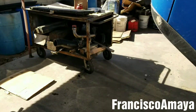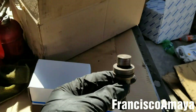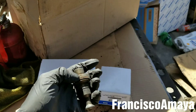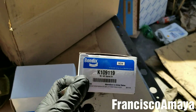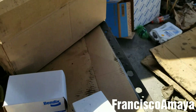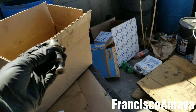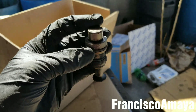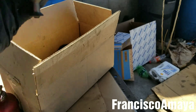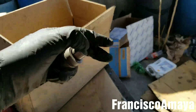So, for that you're going to need this part over here. This is the unloader valve — that's the name of this one. This is the brand new part. What this does is this is the valve that goes on top of the head of the air compressor, and this is the one that opens and closes the compressor when it's time to recharge, or when it's time to stop the compressor and it does the discharge.